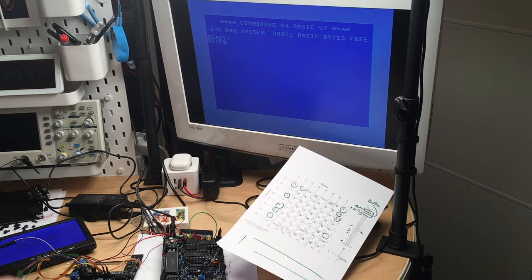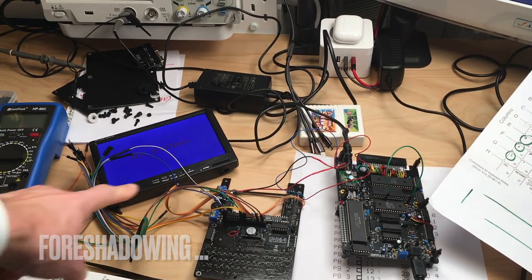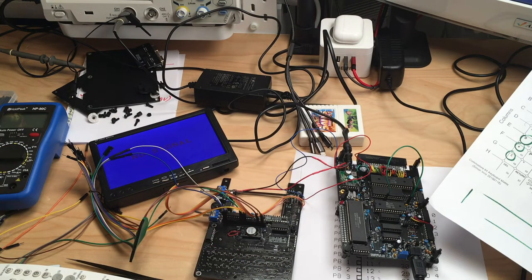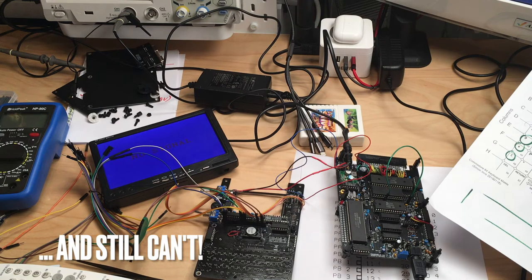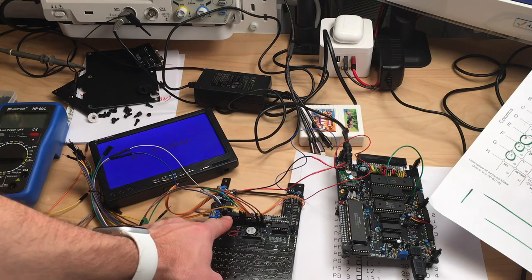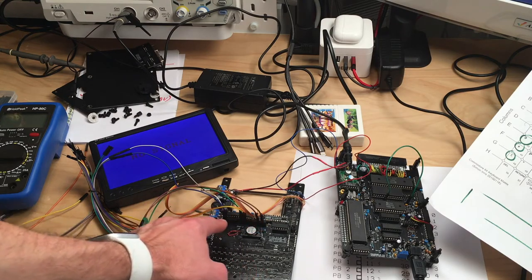So now there could be two faults. The first fault could be that this wiring doesn't simply work. Maybe the cables are too long, I don't know. But since that wire actually works and the other two wires actually work, I can't see why that is. Maybe it's the resistance of the cable, I don't know. The other thing could be that somewhere in this keyboard matrix there's an error, but I don't think so. And wait, we could actually test that, I guess. We could also put the multimeter in here and check if we push a button, we get some result here.